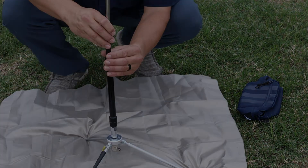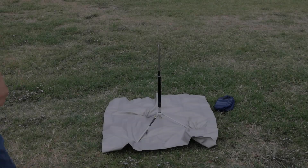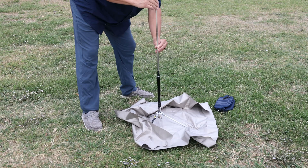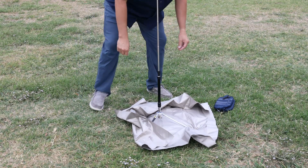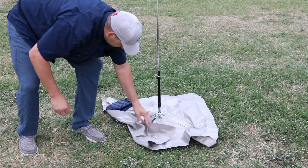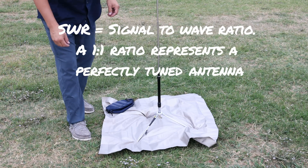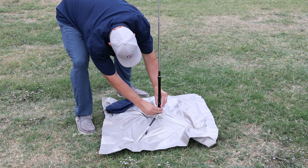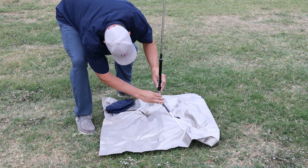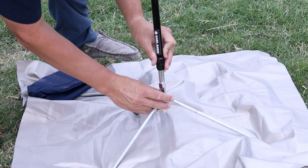However, this system is very lightweight. For the 20 meter band with this antenna, we extend the whip all the way. The light breeze we have out here today is enough to move this ground plane, so we're going to put something on it to hold it down. Although even folded up, it doesn't have much impact on the SWR. For 20 meter, we're going to loosen up the coil and extend it to about three inches on the marker.